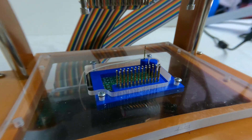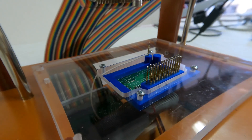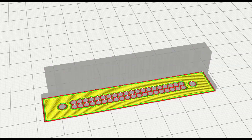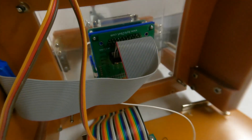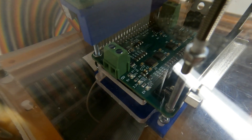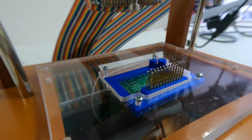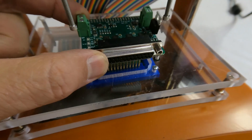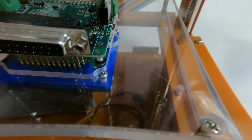If properly designed for testability, the circuit board should have all the test point probe locations on the bottom side of the board. I failed miserably in this regard, so my tester is now twice as complicated. I used a combination of 3D printing and custom printed circuit boards to hold up the pogo pins that connect both the top and bottom of the board. The top pins interface with the 40-pin Pi header, and the bottom pins interface with the DB25 connector. The unit under test is placed on top of the center plate, which should also be drilled as a guide for the pogo pins to keep them from getting bent.